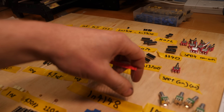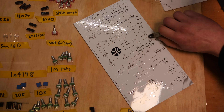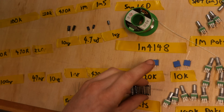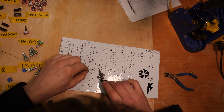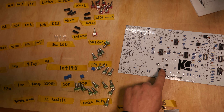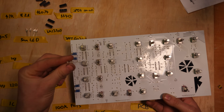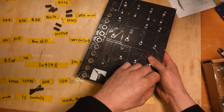It's like washing up a big pile of pots — you just take it pot by pot. Then you put the diodes in. The black stripe on the diodes needs to match up to the black stripe on the diode footprint on the PCB as well. Then we jump onto the ceramic capacitors — these are all decoupling capacitors at 100 nanofarads. Then we do the 10 nanofarads and the 1 nanofarads because they're nice and low. Don't put the electrolytic capacitors in until you've done the IC sockets, making sure that they match up with the footprints and they're all facing upwards.